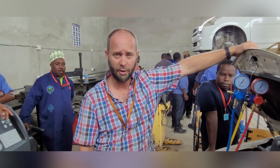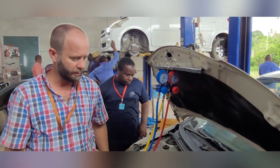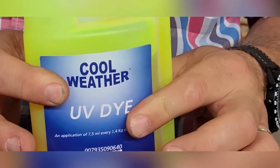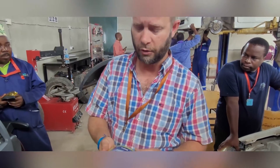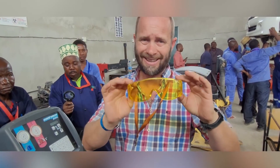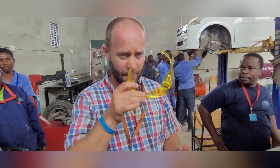The lucky thing is that about four months ago we already put some UV ultraviolet dye inside the system, and we can already see that there is a place where it's leaking. Normally we inject a little bit of this oil, which gives us the opportunity to find out where the leakage is. We will have a different video on how to inject the dye. To detect it, we need special glasses that reflect the UV light so we can see it, because normally UV light is not visible to humans.